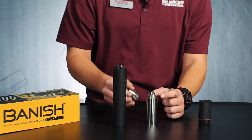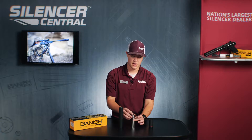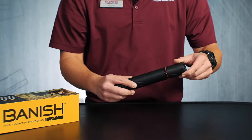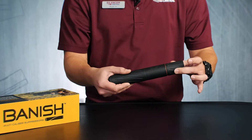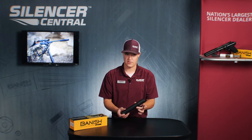As you can see there, those baffles are keyed and you can see all of these ports on the suppressor are lined up. We're going to offset this one, reinsert the baffles into the suppressor and then we're going to reinstall our cap. One of your first telltale signs that your suppressor is not reassembled properly is the fact that you'll still be able to see that orange o-ring when the suppressor is completely tightened. That's your first sign that it's wrong.